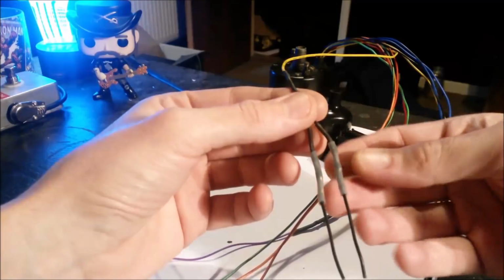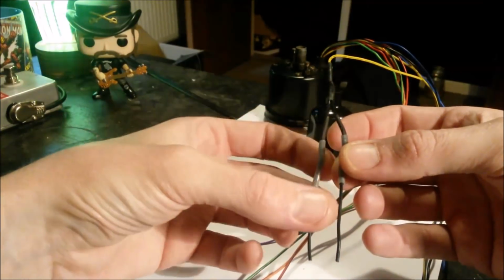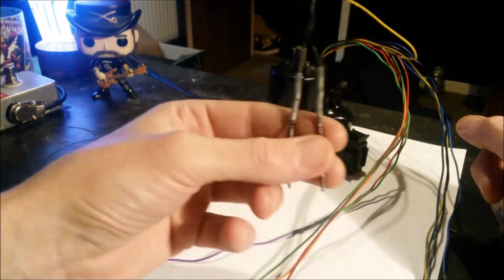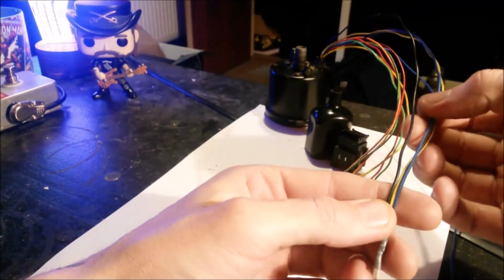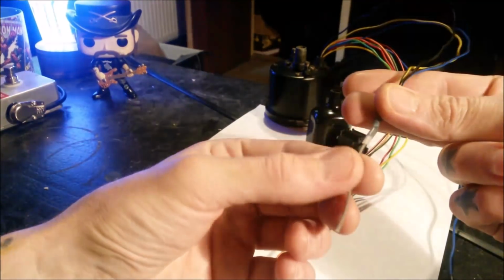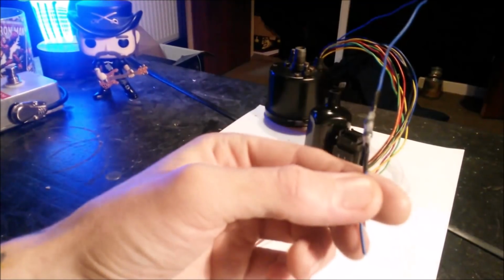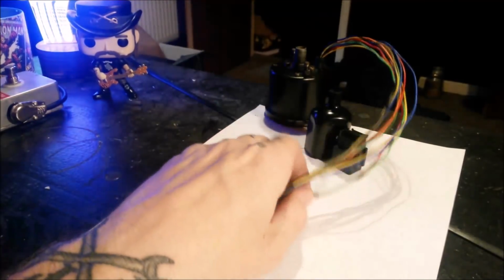These are our turn signal ones now, so we've got the diodes. A single wire breaks into two, goes to two separate pins in the connector, with a diode in line in each wire. So they're ready to be crimped. I've got all the remaining earths: backlight negative, high beam negative, turn signal negative. They're all soldered together, heat shrunk, and going into grey. And then we've got the high beam main positive with the resistor in line. So they're all there.